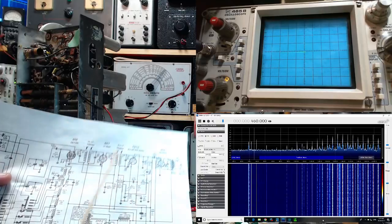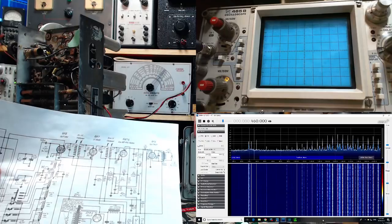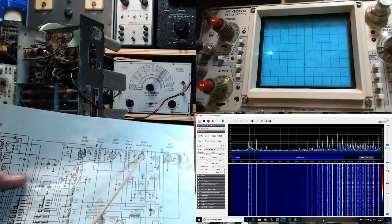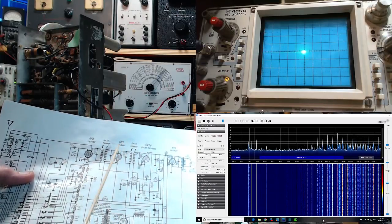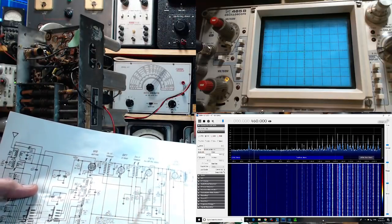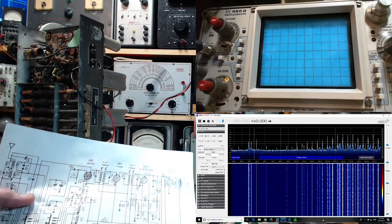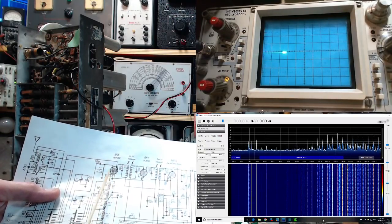I swapped this tube out — it had no bearing that I could pick up on the IF string or anything about the radio. The radio seemed to be perfectly stable. So the question I'm asking is: if you stick different tubes in, do you need to stop and retune the radio to compensate for the tube's own variations? Or else you could have a medium tube here, pop in a really good tube, detune this and conclude the really good tube is not a really good tube — but in fact it is. That's what I'm kind of poking around with here. And I just didn't do this one, but I'm going to do it today.